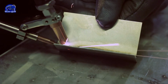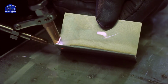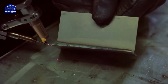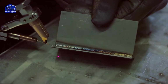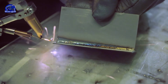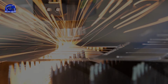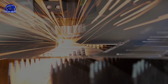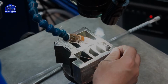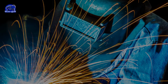During the welding process, the material is rapidly heated by the intense laser light, typically within milliseconds. A laser beam is coherent, single-phase light of a single wavelength, monochromatic. When a laser beam strikes a surface, its low divergence and high energy cause it to create heat. LBW is no different from other forms of welding in that details matter. Different lasers and LBW processes can be used, and laser welding isn't always the best option.